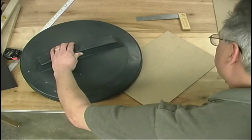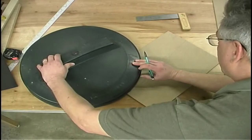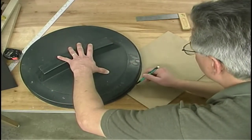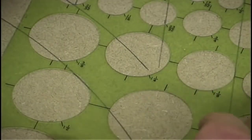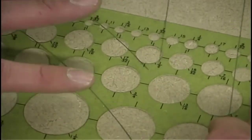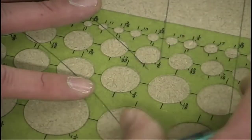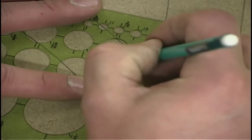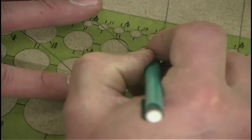And to help with layout, sometimes even the most unusual inanimate objects, such as a garbage can lid, work out for the perfect radius. And when creating these small blended radii in the corners, a drafting circle template is a wonderful tool. We'll just line it up. We want a 1/2 inch diameter circle in there, 1/4 inch radius. So I'll just line up the edges of that circle with our lines, pencil in the radius, and then they provide these handy little quadrant marks.